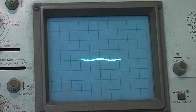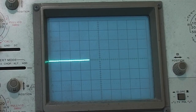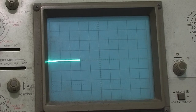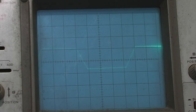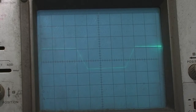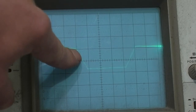And then the other one, I'm just pressing up on that. The sampling position. How you do that is you supply a signal to the machine and scope test point 9, and that gives you the servo ramp waveform. Well, it's easier to just do it, and you'll see you have to get a symmetrical sort of overshoot. Right, so I've got it in record, and I'm triggering from the video signal, and I'm scoping that waveform at test point 9. So you see this, that's the sampling point that's generated by the video signal coming in.